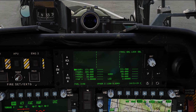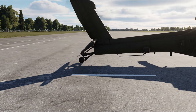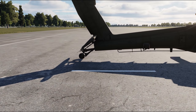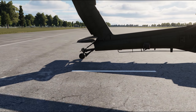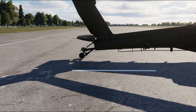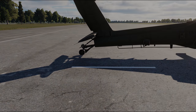So let's take a look outside and see what's happening. I'm going to hit the nose down switch, and we can see the Stabilator is moving down to change that airflow — that's going to push the tail up and the nose down. And I'm going to hit the nose up, which is going to push the tail down and the nose up. Then I'm going to hit that reset depress, and it goes back into auto mode.